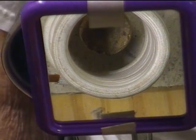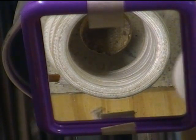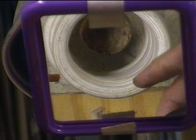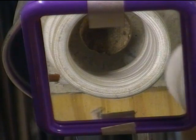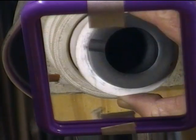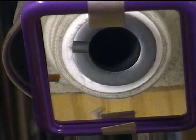We've got 6 amps. So here we go, we're going to put this crucible in — it's a little different than the one I've been using. Hope you can see that. 37.7 kHz current, 38 amps, 42.8 kHz — that went up to.